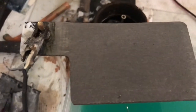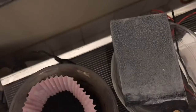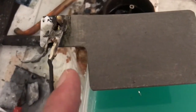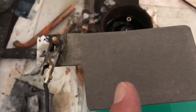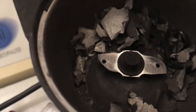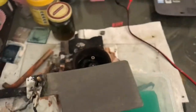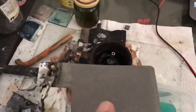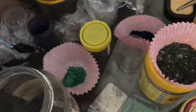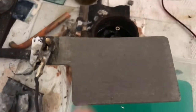Coming up in the next video is a similar sort of construction, except it's going to be the flat version. So we're going to be using nickel and zinc plate. We've got two of these plates of zinc, which go on either side of this plate, which is copper coated first, because the first time I tried just with the conductive ink, the nickel flaked off in big chunks. I crushed it up, but the little blender there, as you can see, is ground too much carbon and the blades are worn off. So what I'll do now is paint some conductive ink on here and sprinkle the nickel hydroxide. That's got carbon mixed into the nickel hydroxide. So that's the next video which will come. Hopefully this battery performs a bit better.